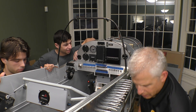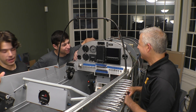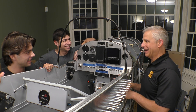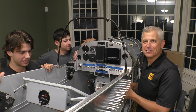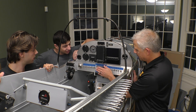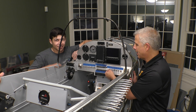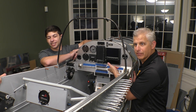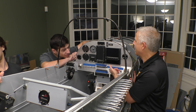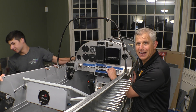This is nerve-wracking. We're more nervous about screens staying black or something else. Everybody did a last check — powers, grounds, loose wires — yeah, we've been through this a bunch of times. We're going to leave the circuit breakers out. The first thing we're listening for is the solenoids to click in the back. Starting with the primary battery — I heard it click. We're going to try the backup battery — hear that one click too. No smoke — we're good. We've got power.